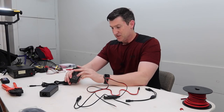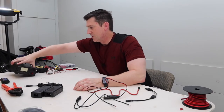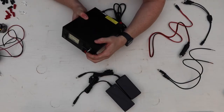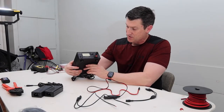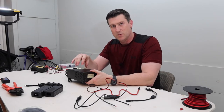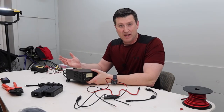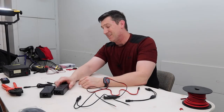I like to convert these to something that's going to stick a little bit better, and get rid of all these power bricks. What we'll do is purchase something like this - a 110 or 220 switching input AC adapter that has Anderson PowerPole connectors on the front. Once I've converted everything to 12 volt DC, I just run down into one of these natively. When I go out in the field I don't need this - I just bring my battery box and plug everything in native 12 volt DC to the battery. Converting it is going to make your life easier and everything a little bit more stable.